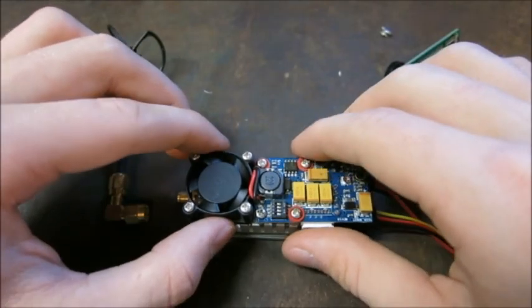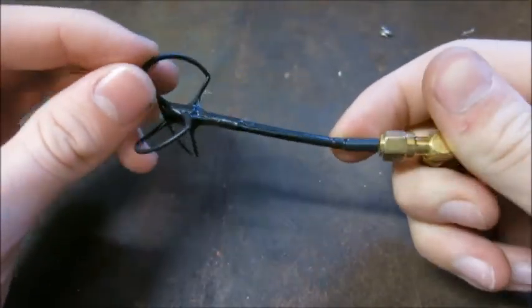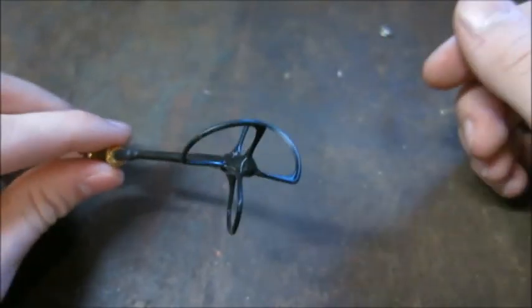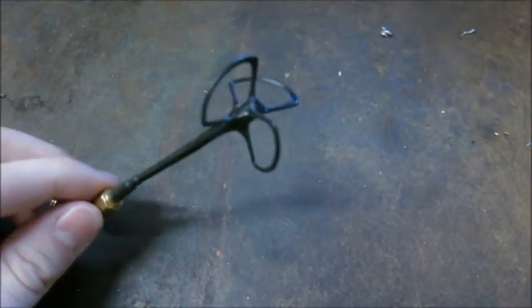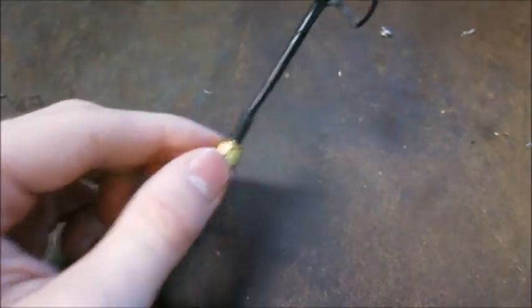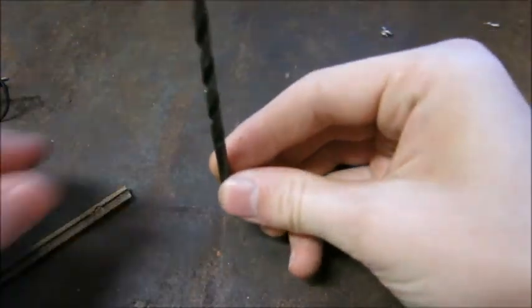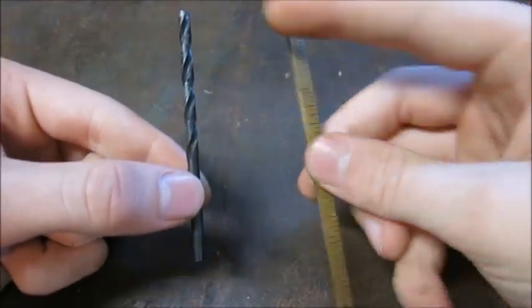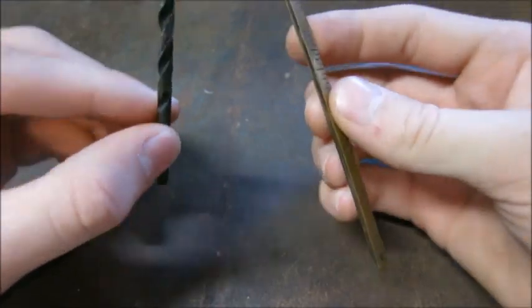As far as antennas are concerned, the best antenna for your money is a left-hand polarized omnidirectional antenna. Some people love the little dipoles, but they're not great, and here's why: a dipole antenna is linearly polarized, which can cause issues when flying at an angle. Say this is your antenna facing upright and your receiver antenna is here — the bandwidth is nice and the signal travels without distortion.